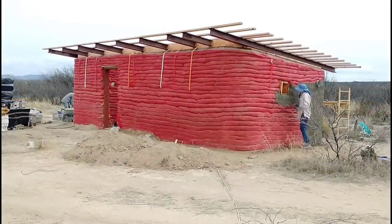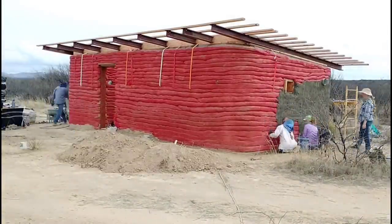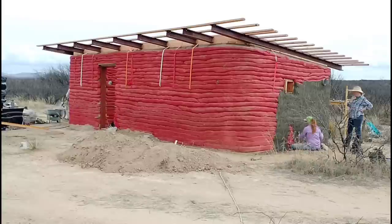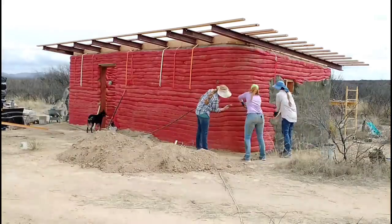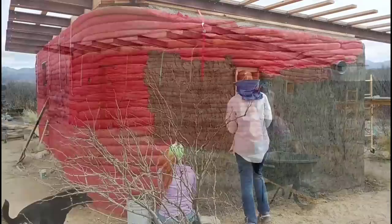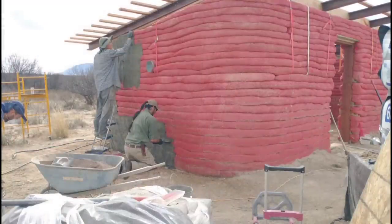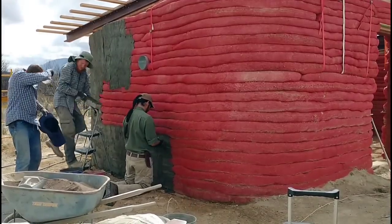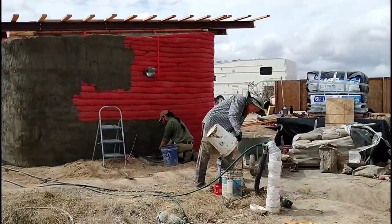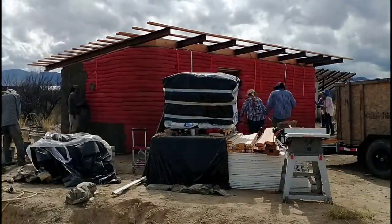We are wetting the walls occasionally before we apply the stucco. Also, the bag material has an open weave, so when you apply the stucco it's able to grab on to that open weave and also make contact directly with the dirt. We plan to put two coats on. This first coat we're putting on a little thicker — trying to even out the wall, fill in any gaps, cover up the straps, and leave a nice coarse texture. The next coat will be thinner and serve as a finished coat. We plan to leave that pretty rough as well, since a rough surface is less likely to crack than a smooth surface.